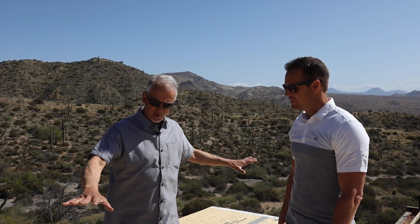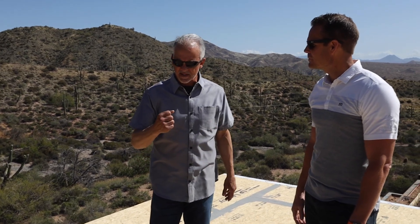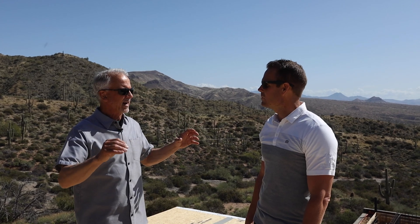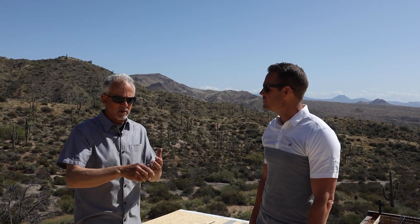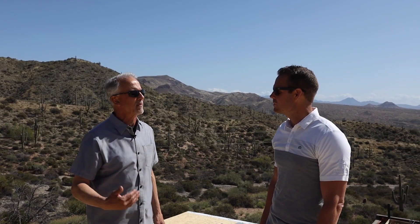This stuff has been bulletproof. I'm going to leave it exposed for a while before we get the roof on it. We've got a panel going on top and then a roof layer going over it. Having something that feels like a lifetime product is amazing, and the price differential is so small in relationship to something as significant as your sheathing. I want to invest in something that feels as robust as everything else — we use micro lams and LVLs, so not going all the way with the OSB when it's the skin seems like a choice we could make better.